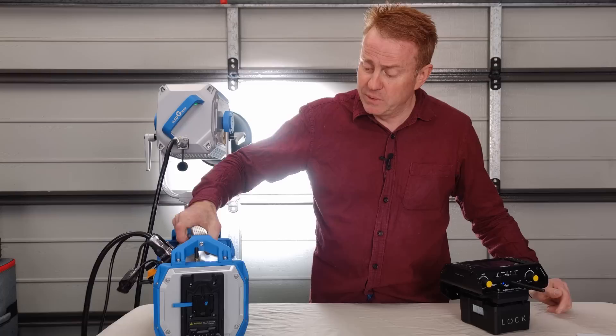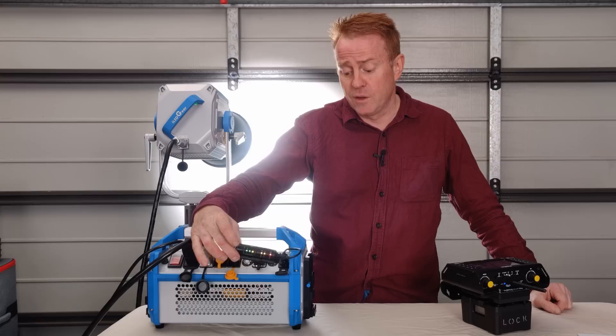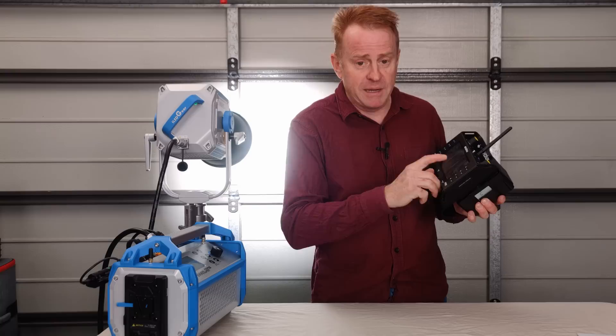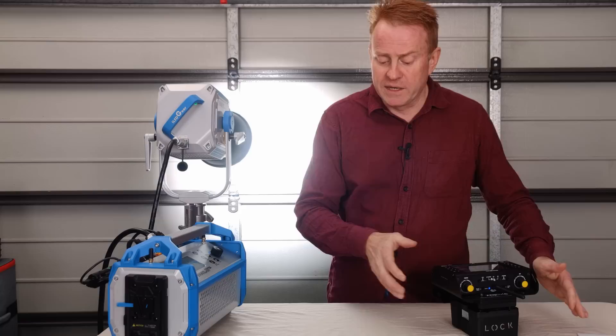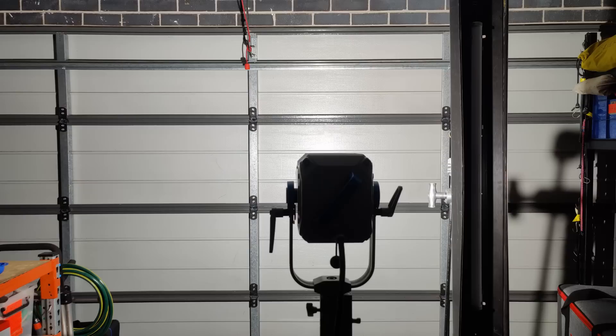Now let's take a look at how the light runs over DMX. It does have its own built-in wireless DMX system, but it is not Lumen Radio — it is a brand-specific wireless system. How I'm testing it today is with a Lumen Radio receiver plugged into the light running off the USB port. It does have great smoothing — so if you're operating it manually or recording a rehearsal, you can make fine adjustments without the light shimmering. One thing to note: it does have only one DMX profile. Channel one is your brightness, channel two is your CCT. It's just a basic 8-bit profile.